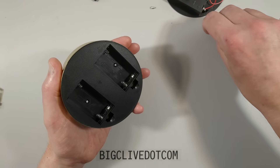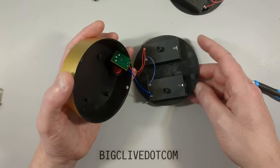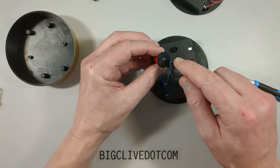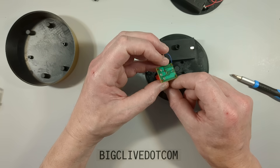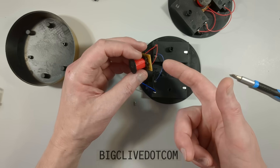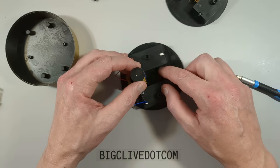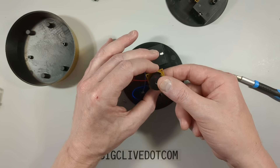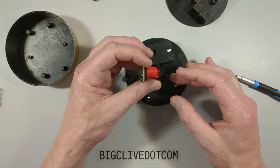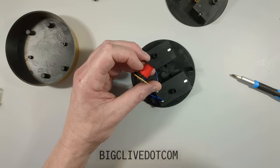Watch me mix all these bits up - I'll put the little screws over into the black base. They're looking very similar so far. This one has a little sticker over the top - maybe that's to stop the metal plunger. This one has a screw holding it in, and this other one is simply on pegs with a bit of foam to stop it rattling. I'll take a picture of the back, take some measurements of these coils, draw a schematic, and we can explore these machines.